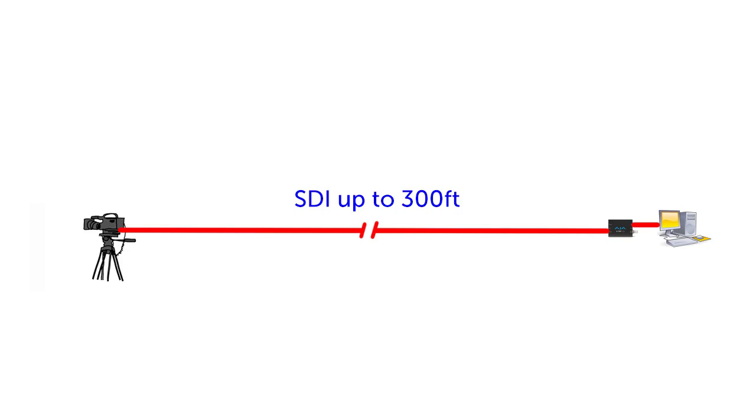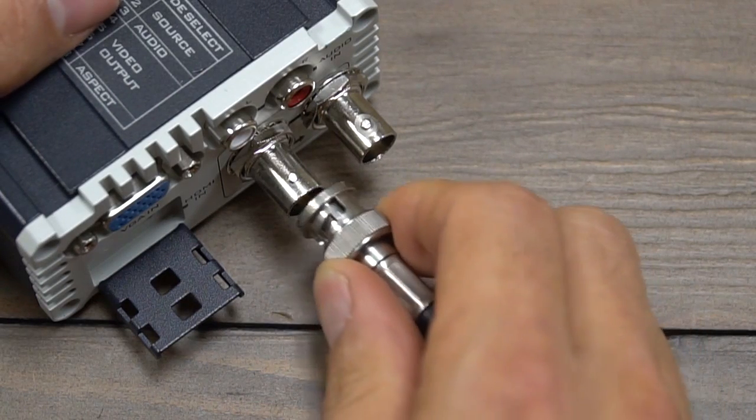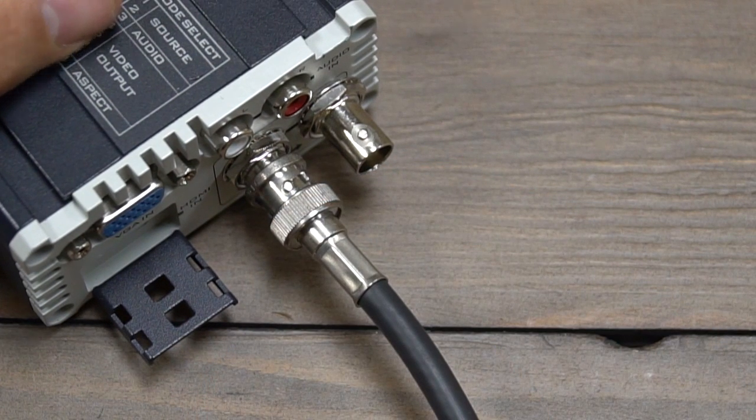I wanted to make a video to show you how to make your own cables. As you build out a video system, there are a lot of advantages to using SDI instead of HDMI. You can send SDI cables over longer distances. HDMI really is only designed for 15 feet or less, so anything beyond that is going to involve some sort of gimmick. I also prefer the locking BNC connectors, so I usually design a video system around using as much SDI cabling over HDMI as possible.